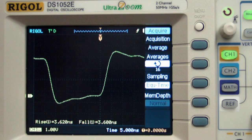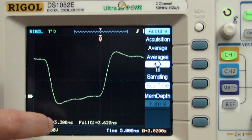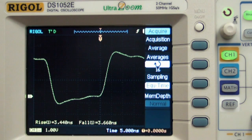So there's a whole lot, but as always, you get what you pay for. So don't buy those eBay cheapies. 50 or 100 bucks can get you a good quality meter. So what can I do but publish and be damned? Let's just check the rise and fall time here, 3.5 nanoseconds, as you can see, so that's 100 megahertz bandwidth.